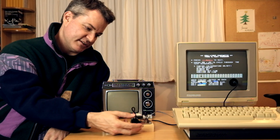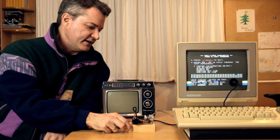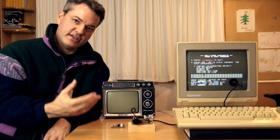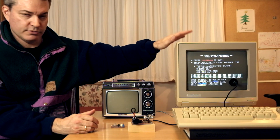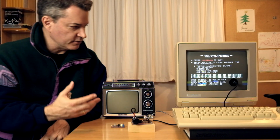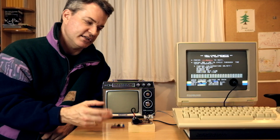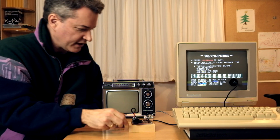The other changes I made are optional. Having the sensitivity adjustment is nice, and shielding the sensor is certainly a good idea, but I think neither is strictly necessary if you have a decently bright CRT to work with. I also wrote a much improved version of the tuning program that actually measures the pulse width and gives you immediate visual feedback about it.